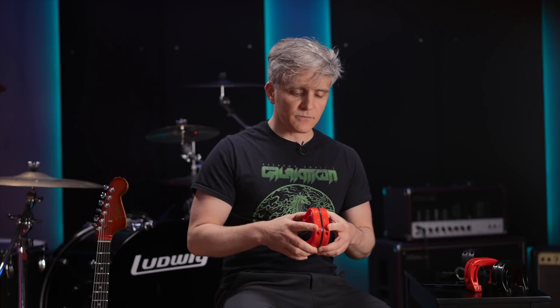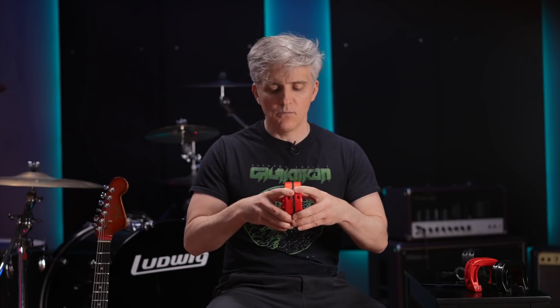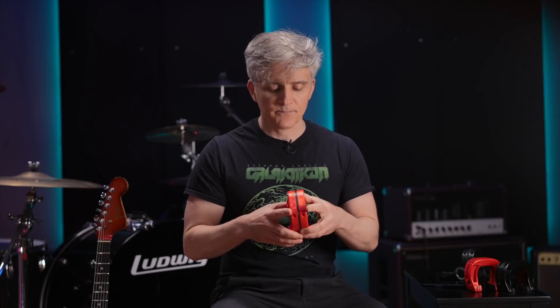This sample, as it stands, works great. But I'm a little concerned about the grippiness and the possibility that units might come off the line working worse than this — that could be a problem. So we're due to get another batch of samples in a couple of weeks, maybe two or three weeks. We've asked them to take a look at the smoothness of the operation. It could have something to do with the tolerances — if you let these things cool longer or take them out after less cooling time, it can influence in small amounts how big these parts are, which influences how well they fit together. It could also be that this material is a little bit stickier than the previous ABS.